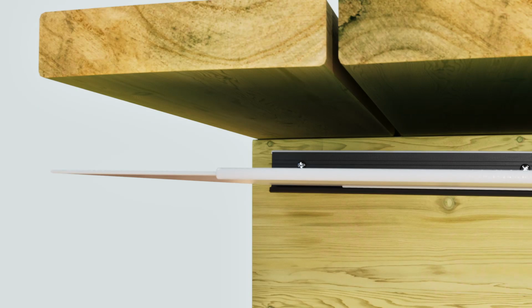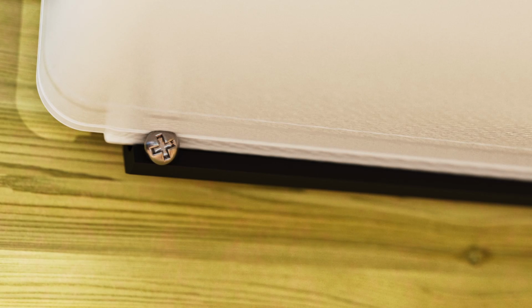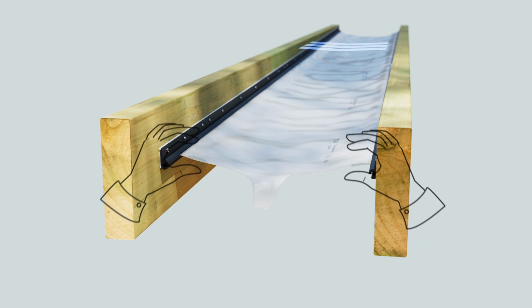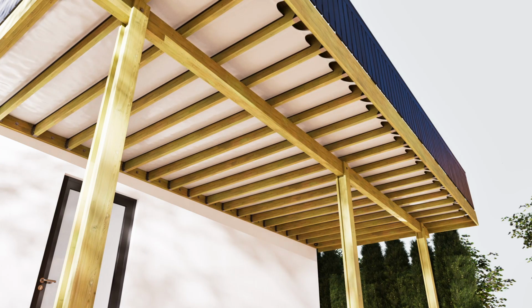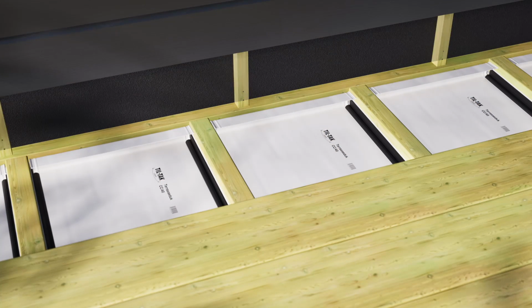Stretching the canvas is needed. Attach a screw through the track and canvas rope on each side close to the wall ledger. Stretch the canvas. Use some force. It can be stretched approximately 1 inch per 10 feet. Attach screws in front to lock the TIL-TAK canvas in position. We recommend removing 2 deck boards for dry transition and cleaning of debris.